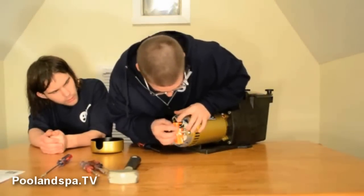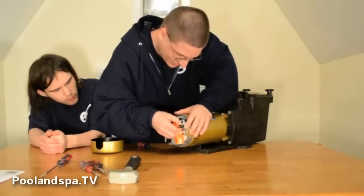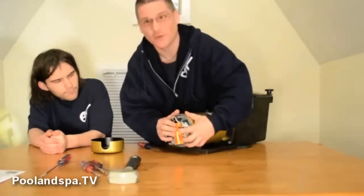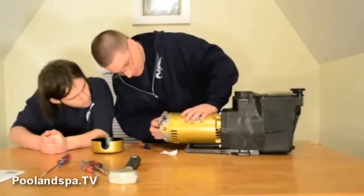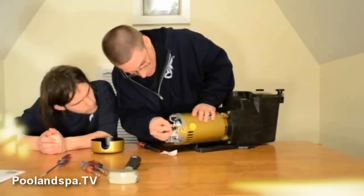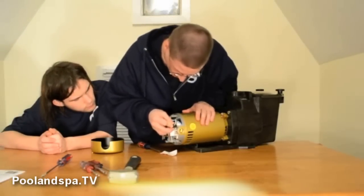The orange sticker will tell you that if you want to change the voltage, all you have to do is pull this little tab off, just like this. And if you just slide it down to this position here, that will wire it for 110. You want to put it back to 220, you put that back. So if you want to plug it into 110, you put it right here, just like that. You want to go 220, just like that. Just as simple as moving the little prong tab, and then you're done.